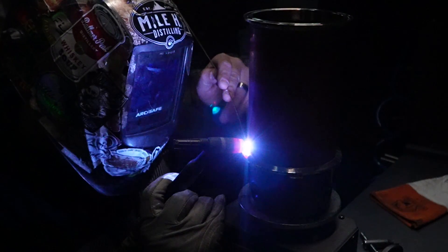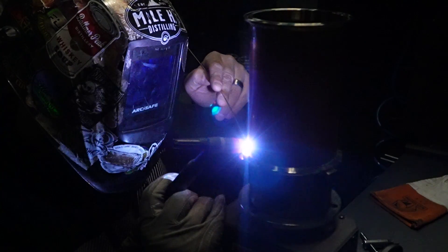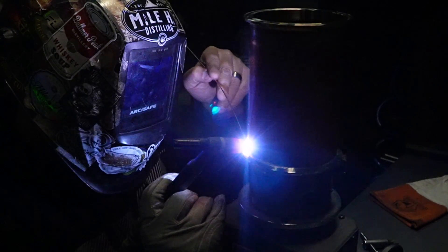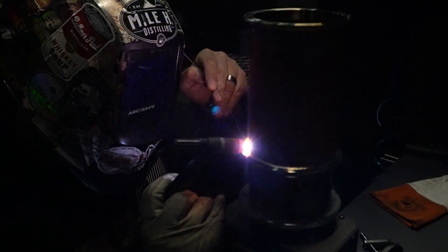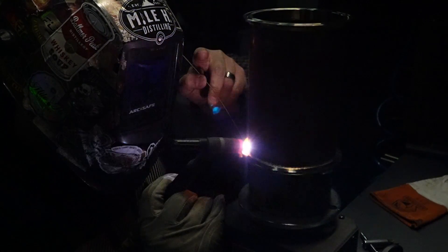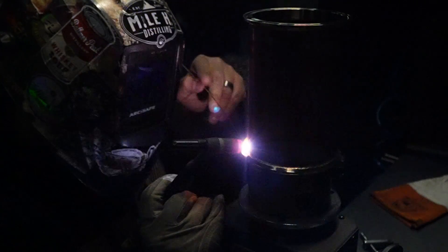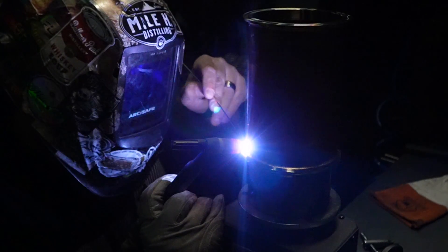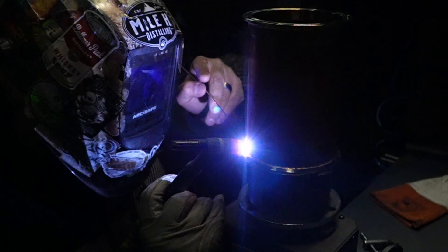This is where it really begins. We're going to start by welding up. You're going to see Noah with the silicon bronze rod — that's what we use to fuse copper to stainless. He's at 137 amps and 3.5 pulses per second on his welding machine. Not all welding machines are going to have that pulse setting, but it does make things easier. Stick with it on that rod. Get everything nice and smooth. We have our positioner in place so it's just steadily rotating. Noah is really good at what he does — if you guys are liking Noah's work, please leave a comment.